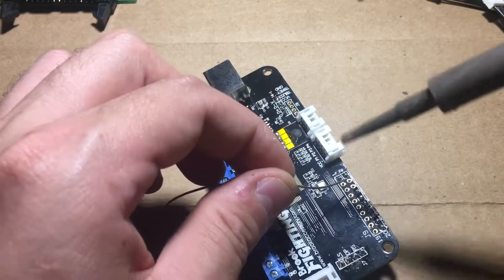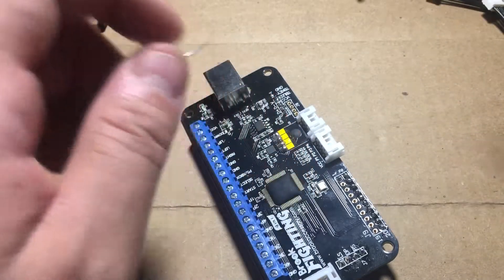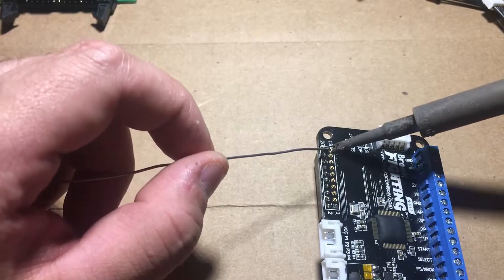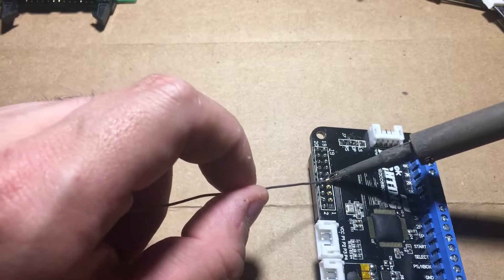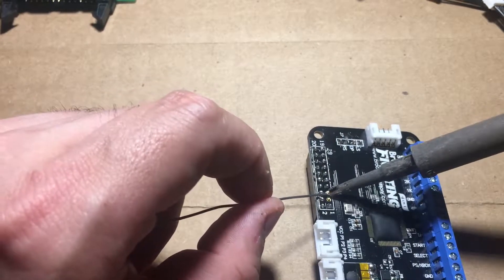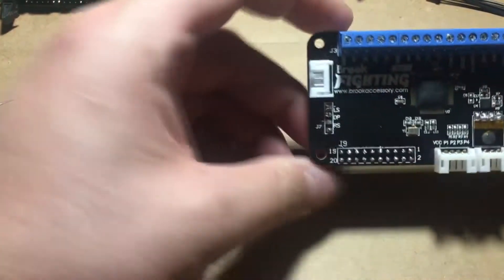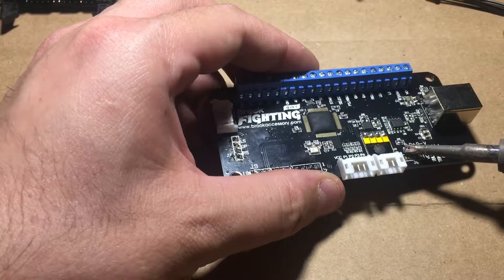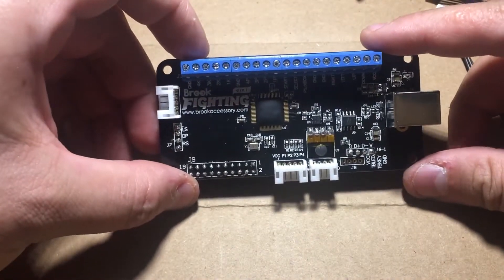You'll see the solder is silver and the pins are gold, so just try and hide the gold if you want to think about it like that. So let's look at what we've done: got the 20-pin connector on, LS/RS/DP, USB, and these other headers too. There's a lot of solder on this ground — but we're okay. That's the extent of soldering now.